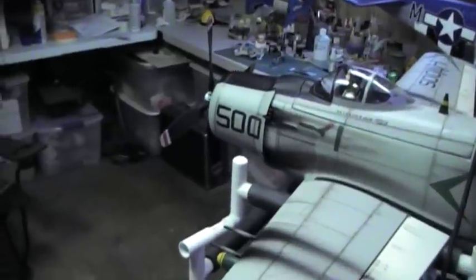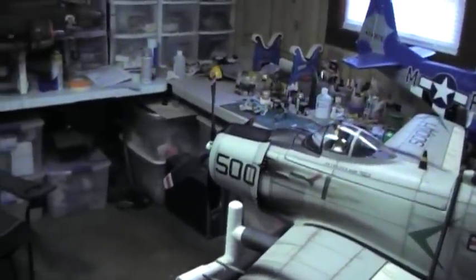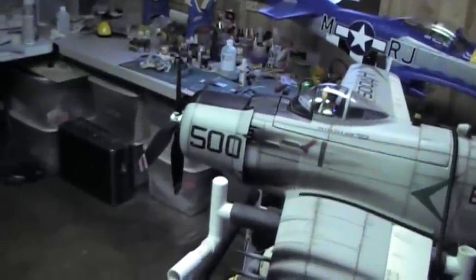In the model sound selections page on the step breakdown, what I did was adjust the top end percent and bottom end percentages on each of about the top six sounds from the startup down, and adjusted them a little bit so that it coordinates better with my particular ESC and throttle here. It's something you'd have to play around with for your specific application, but it worked real well for me. For instance, I have the shutdown sound set at 0 to 3.5% instead of 0 to 5%, which he recommends. The lower setting just worked better for me on this one.